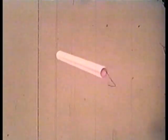Let's start with this ordinary steel bar. If the bar is heated thoroughly and uniformly throughout its entire volume, considerable expansion in all directions will take place. Now, if the bar is allowed to cool evenly without restraint of any kind, we know that it will contract to its original shape and size without distortion.